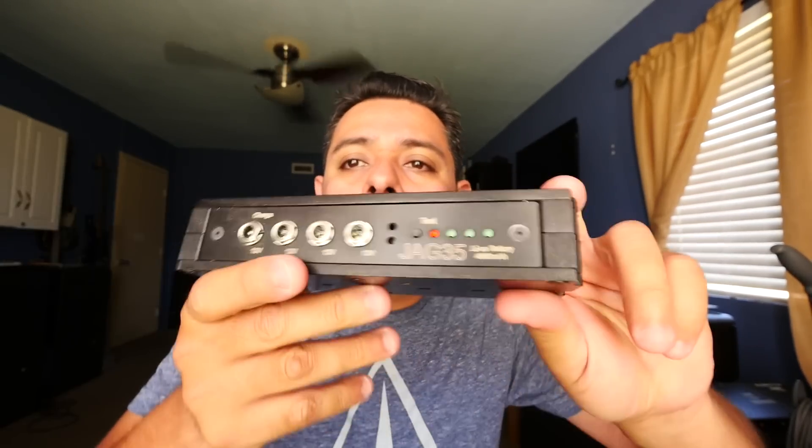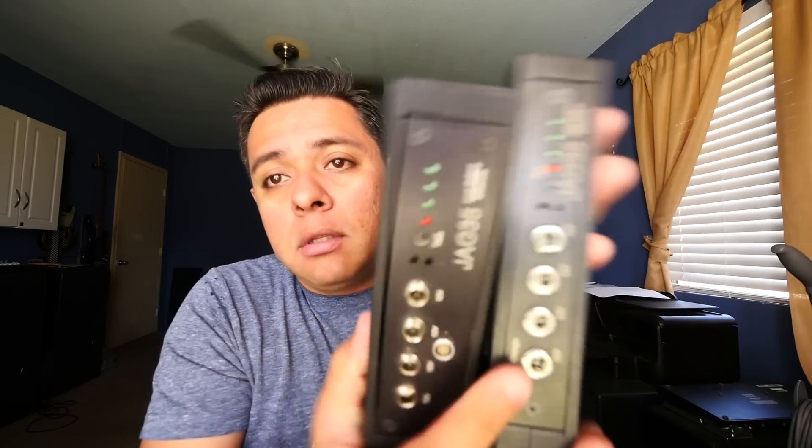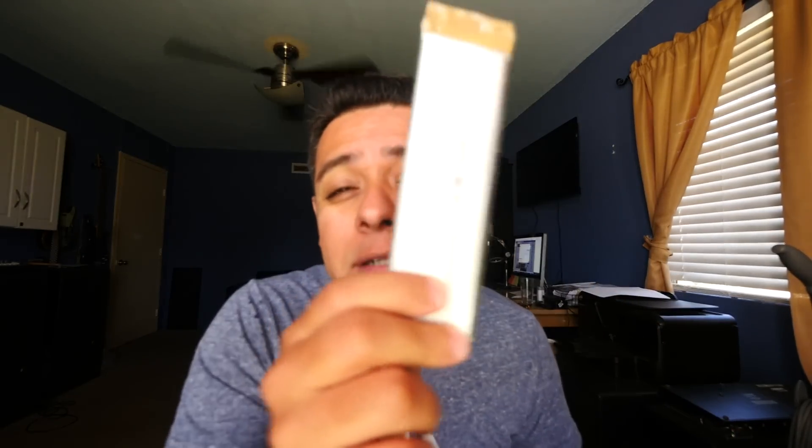Alright, batteries — you know them, they look like this. This is an old battery that we made at Jack 35. 12 volts, used to power cameras, pretty much anything that's 12 volts. Here's a bigger one. Here's some you might recognize — these are LiPo batteries for RC. Those batteries are made out of cells; these ones have three individual cells. This is an 18650, a lithium ion battery: 4.2 volts fully charged, 3.7 nominal, and around 3 volts is completely dead. These LiPo pouch cells have pretty similar voltages; the only difference is the polymer casing.